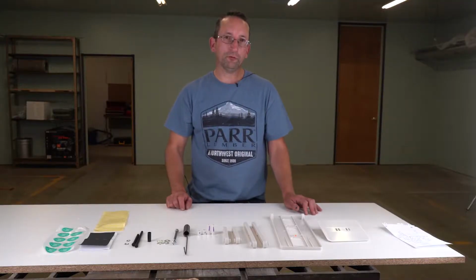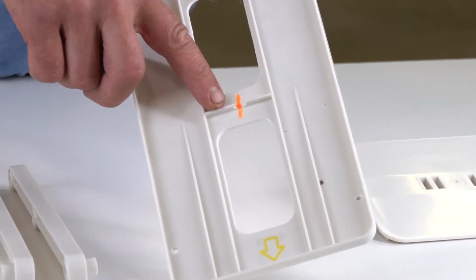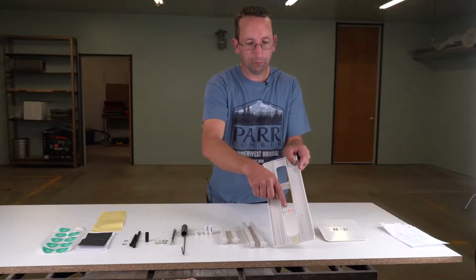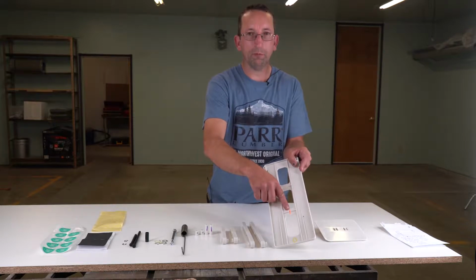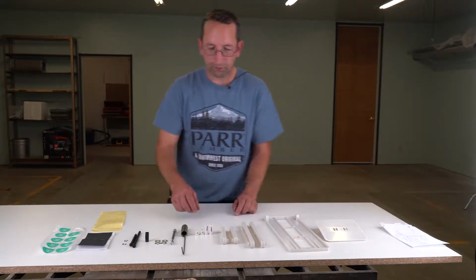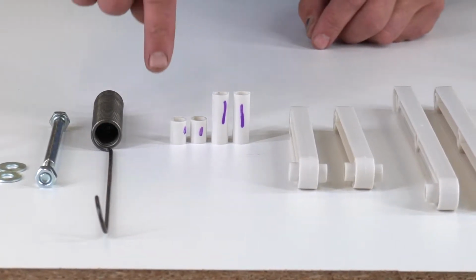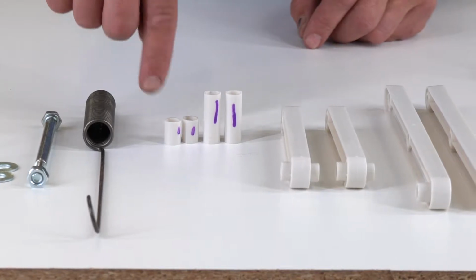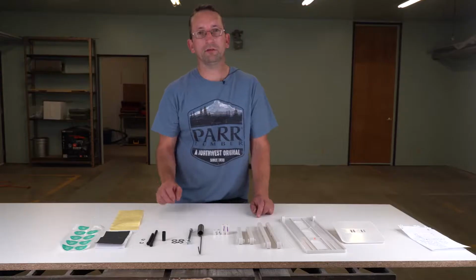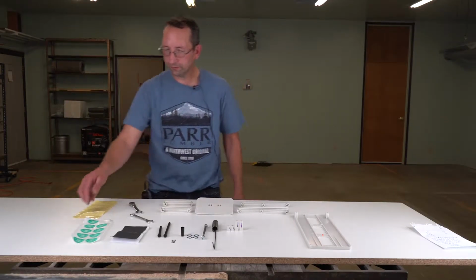Modifications to existing molds include a 6mm gap placed in the base plate, marked as orange on both the models sent. Modification to the mold also includes thickening spring spacers long, thickening spring spacers short, marked as purple on demo model sent.